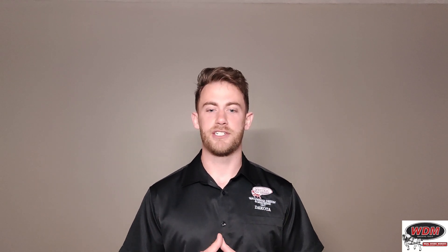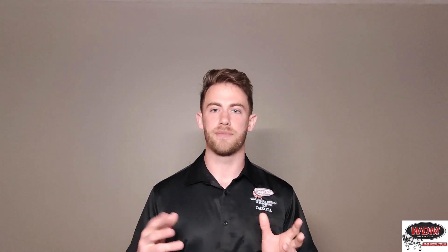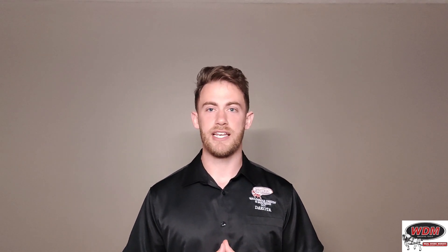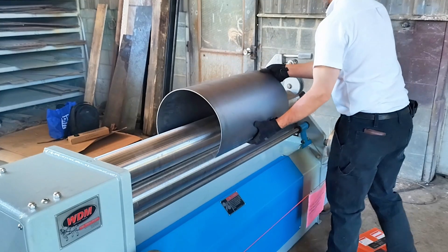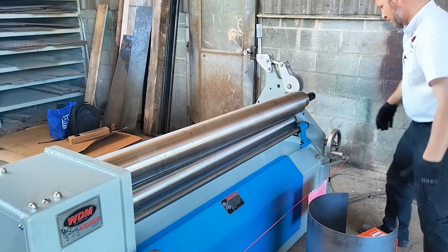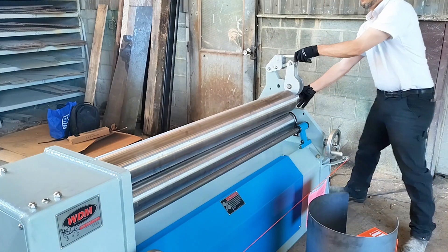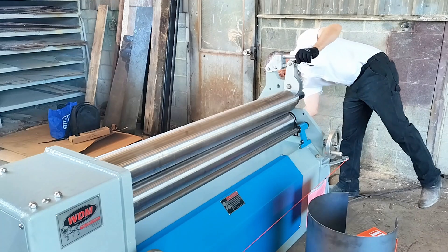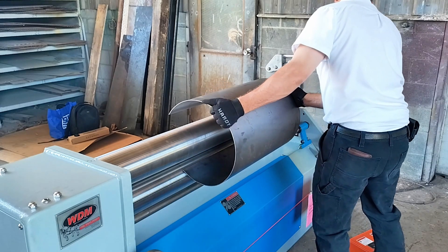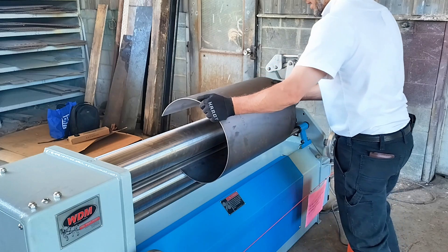Hopefully that explained the standard rolling procedure for initial pinch machines. This is also applicable to the K-Series, which has a drop-in plate — slightly different — but the rolling procedure is the same on any initial pinch plate roll to achieve the most concentric part with minimal flats on the leading and trailing edges. When learning to roll a new part, it's always easier to start bigger and get smaller — just keep re-rolling the piece and working it to smaller and smaller diameter. Each time, square your workpiece in the squaring groove and keep adjusting the bending roll up.